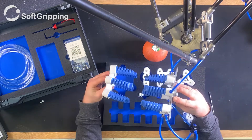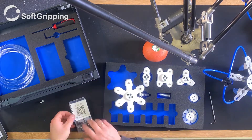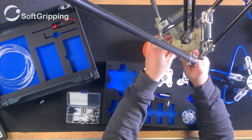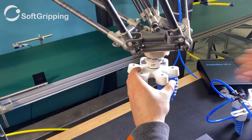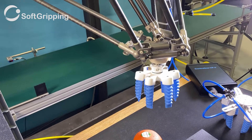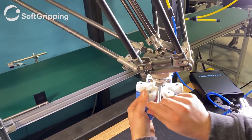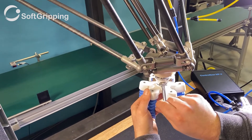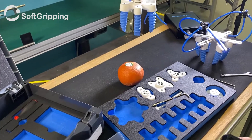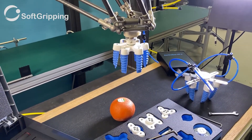It fits like a glove. As with the engineering kit, we attach the flange adapter and grip it to the robot. The adapter is where there is a major difference between soft grippers and soft actuators. In soft grippers, the air supply is delivered internally, and the inlets are located as far as possible from the actual fingers.